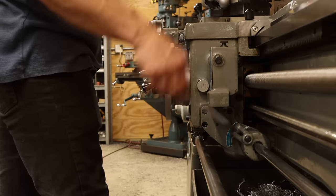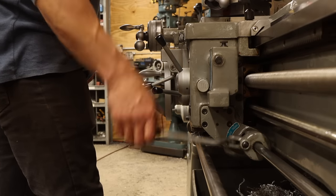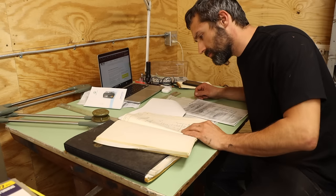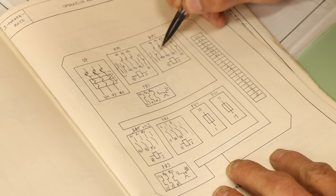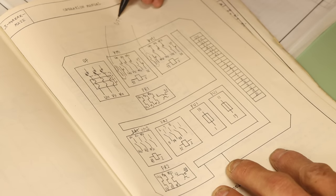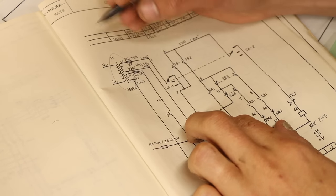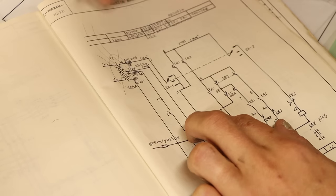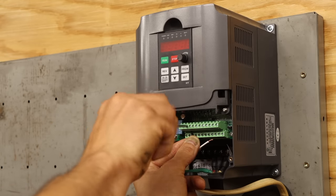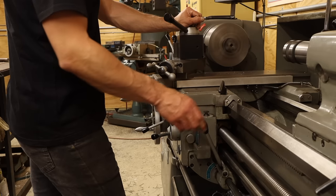I'd like to be able to still use the lever switch on the carriage to turn the lathe on like normal, so I need some way to get signals between the lathe and the VFD. The VFD already has terminals for these input signals, so I just need something on the lathe side. After some poking around, I discovered that each of the motor contactors have unused auxiliary contacts that I can piggyback off of. But there's one small problem — I'm going to need another power source. The current control circuit is 110 volts, and this power comes from a transformer. But I can simply bypass the transformer part and connect my own 110 volt power, leaving the rest of the circuit intact. Then connect my inputs to the extra contacts — and bingo! The only thing left to do is tidy up the wiring.